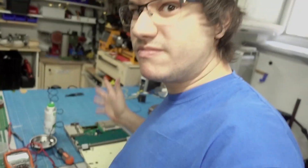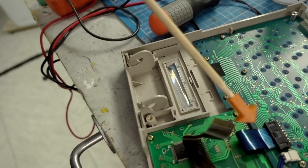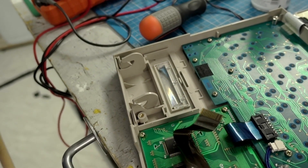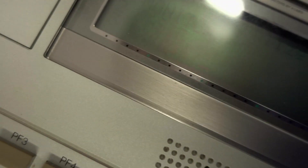It does beep sometimes, but I don't get any picture on the screen. Beeping is usually a good indication that it has booted correctly, and it also means there's a connection from the motherboard over to the keyboard and the display via the two ribbon cables. After a lot of poking around, I can see the shimmer of signs on the display — very hard to tell on camera, but there are letters that could spell 'Basic.' So it lives, but it's very faded and dim. I need to play around with contact spray, clean the paths, and maybe charge it a little bit more. We're getting somewhere.